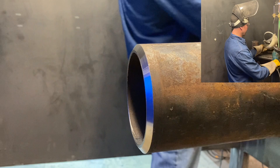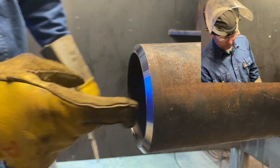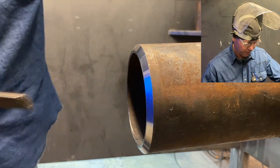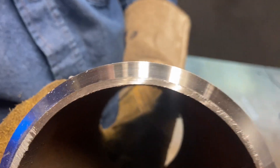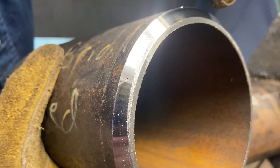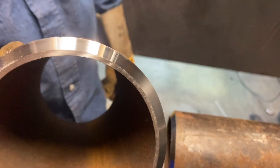There you have it — probably took less than a minute to go from a nice edge down to about a 3/32 land. Just like our video with the 2G plate, we're going to reach in there with a file, knock that burr out of there, make sure our land is exactly what we wanted. There's what it looks like — put that disc on there flat. Western Welding Academy, the only place I know of that will get you a bevel like that when you're learning how to weld. Prep's done. I got the gap set at about 3/32, about a 3/32 land — we're ready to start welding on this.